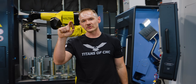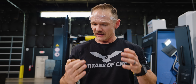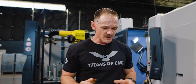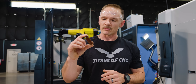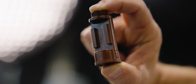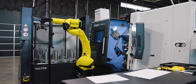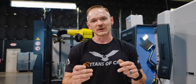Here it is — over $300 worth of Vespel in this small little part. Again, I want to emphasize: it's not the difficulty of machining but the cost of this material that you want to keep in mind. Everything you do — from a small nose radius like we mentioned, to surface finish — don't let a tiny detail become a big problem. We went ahead and parted this off to show you, but normally we'd grab it with our sub-spindle. This machine is on its way out next week, so when our new machine comes in we'll show you what that looks like. Thanks for watching — hit that like button, hit subscribe, and we'll see you next time.